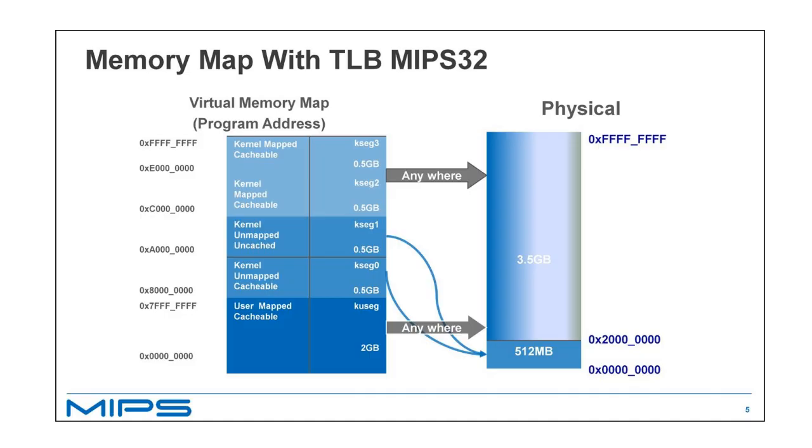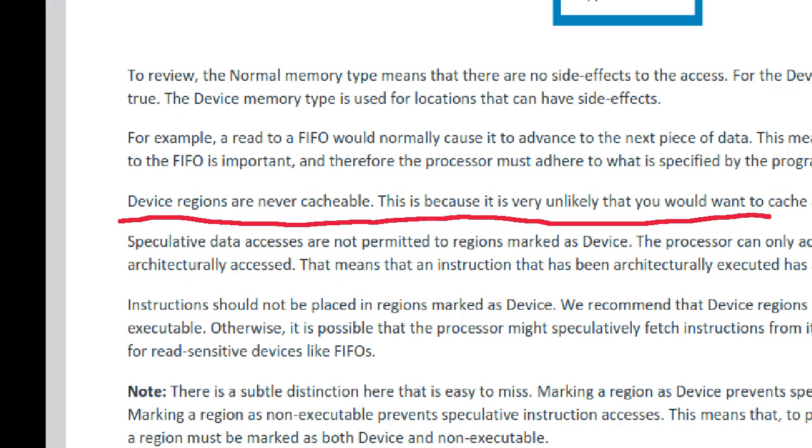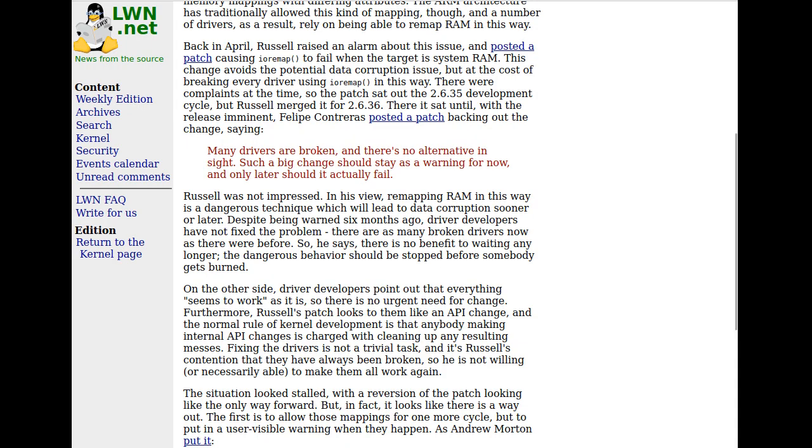On the MediaTek MT7688 chip, which was a MIPS-based chip, the MIPS solution to all this is to have a region of virtual addresses which mirror the kernel memory, but access it without caching. However, ARM does not allow one to double map a physical address like this. One of the ways the Linux people dealt with this was abusing a function that would remap an address range to act as a device. However, this supposedly would cause unpredictable behavior in some versions of ARM CPUs.